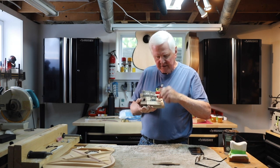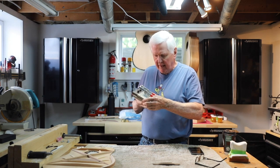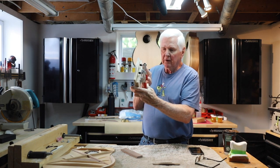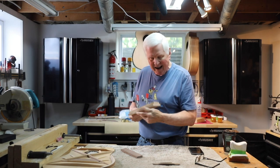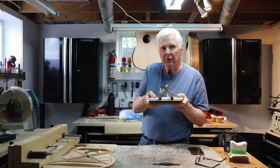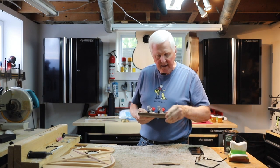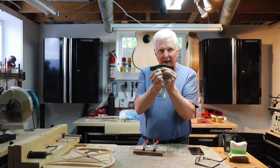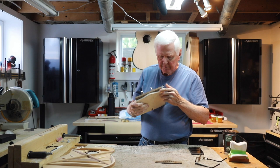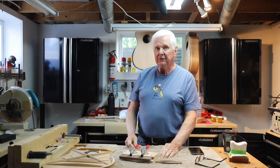The reason for the second piece is to keep the depth and to keep it straight and square. I've got about six screws in here and I've put these Bessy clamps on here, which you can buy at any hardware store. They just go down like that and hold the wood in place so that once this is kind of cut to shape, you sit this in here like this, clamp those down — there it is. Now you go to your router table where you've got the router mounted up underneath and you simply start here and run right back down to here and down to this side. You'll end up with a shape like that. If you want a different shape — coming in more and coming up — you can do that by changing it here, because this is going to follow the guide on the router table when you're going back and forth. So it's very simple to do, very easy.